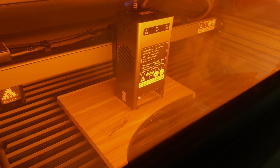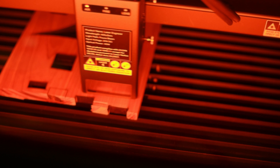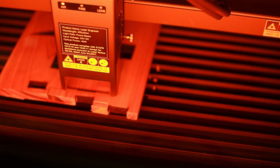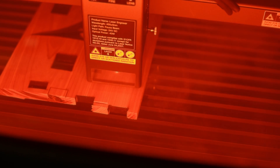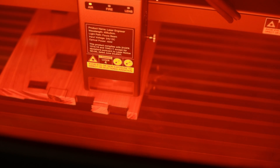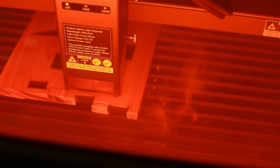The other material I use a lot is cedar — half inch thick cedar. Looking at the tables it seemed like they were just suggesting the same speed with less power, which doesn't help me. So I tried 300 millimeters per minute, which is my typical speed for cedar, normally requiring two passes. With the 40 watt version at that same speed it only required one pass to cut through the entire cedar. That means it will cut my production time in half, and that's where I got very excited.